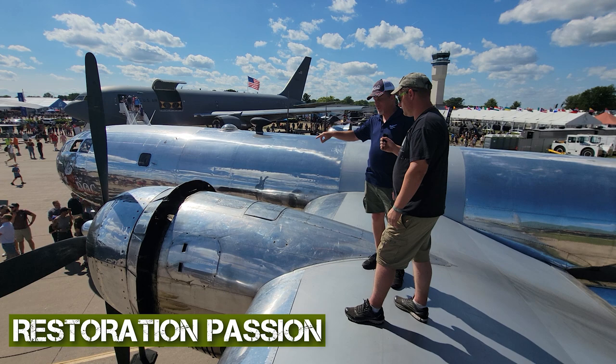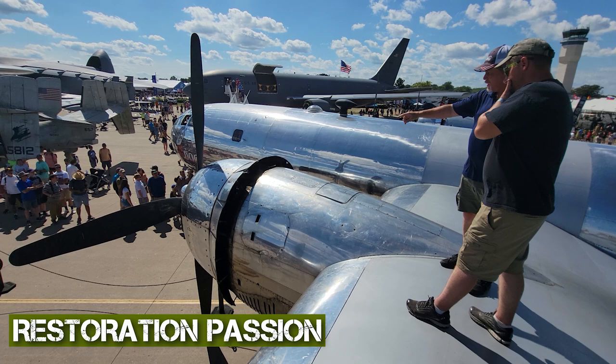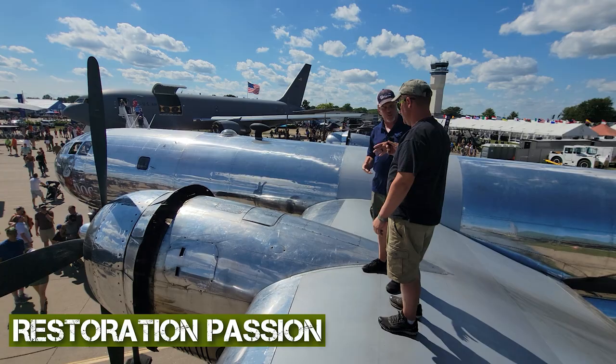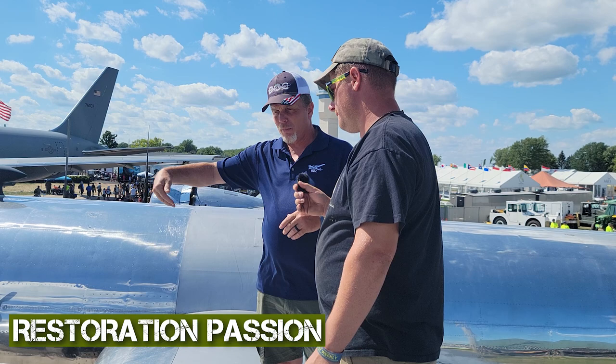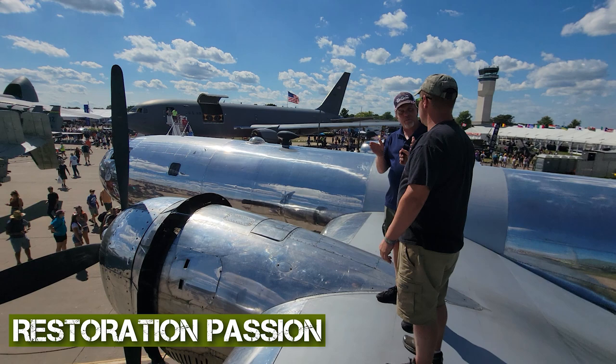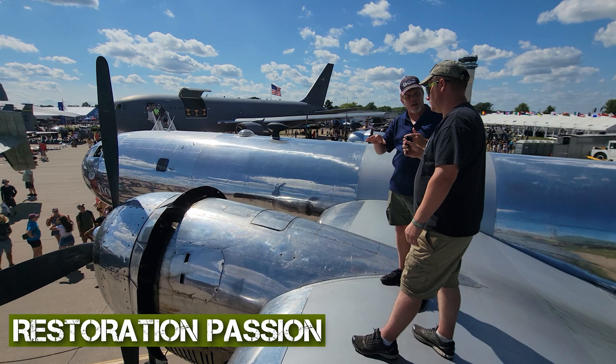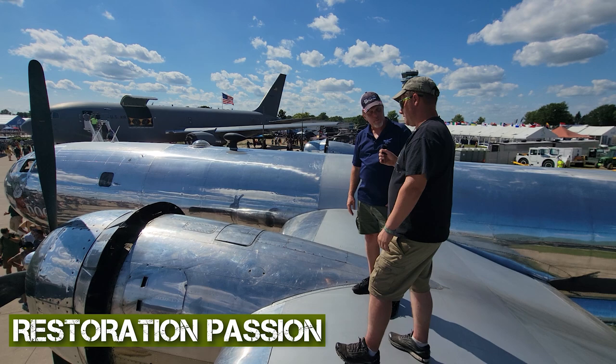What's the purpose of the retractable flaps here? So this is an air-cooled engine. I'm sure some of the tanks you've dealt with have radial engines in them. So how do you cool the cylinders on them? Ram air from the direction of flight comes over those cylinders, and as the air comes through, you need to regulate the amount of airflow. If it's running hot, I'll open the doors up and allow more cooling air through. As the cylinders start getting too cold, you start bringing the doors closed to slow down the amount of air going over the cylinders, and that's how you regulate the temperature of the engine.